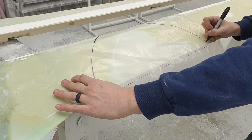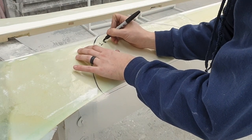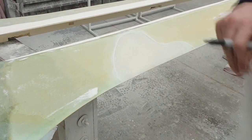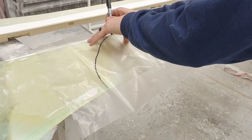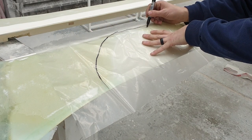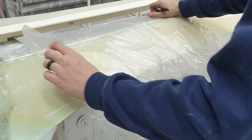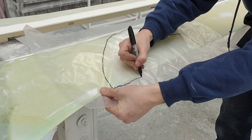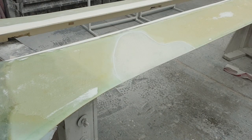We draw patterns — I always like to label them so you know what's what. We draw on the bias at 45 degrees. The second layer will be a little bit smaller; we lay it up on top so you don't have a large bump and can smooth it at the end. The third layer will be the smallest. Now we'll head over to the cutting table and cut some glass to fit our pattern.